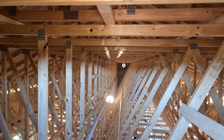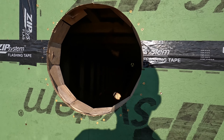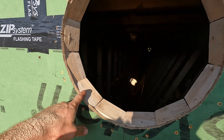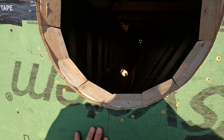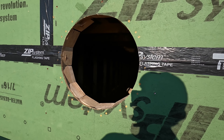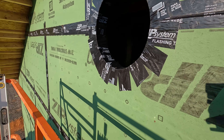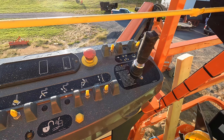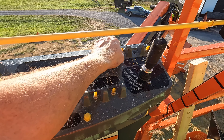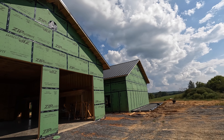This is the last hole. If you look down at the end you can see the fan — I already got the garage fan mounted and the vent hole for it. We'll come back and put a louvered vent over it when we put the siding on. I took some 2x4s and cut some 4-inch blocks and worked them around the radius of this hole to beef it up a bit. That lets me come in and tape this joint so if any water blows in, we can get it waterproofed. We'll put a piece of plastic over it for the time being. She's ready for a vent cover — I'll call this good. The most valuable player of today is this big orange thing I'm standing on — it's been a lifesaver.